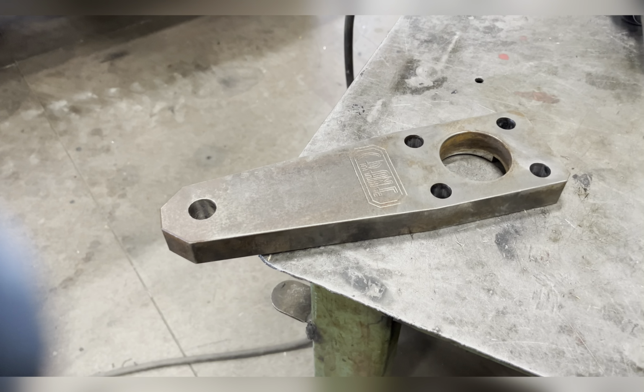First thing I have to do on this is build a mount for the fluid reservoir. And you want to mount these above the rest of your fluid holding components. Welded that muffler clamp in there. This bolts to the fluid reservoir. My panel will clear it, and it kind of gives me room over here still to run lines. Actually gets pretty tight getting all these bolts.